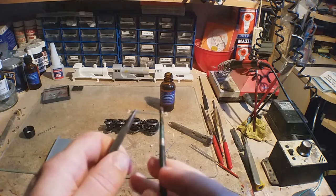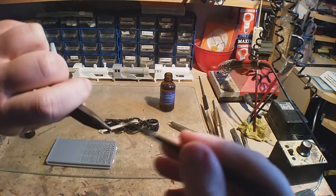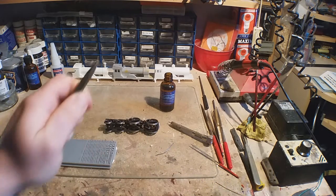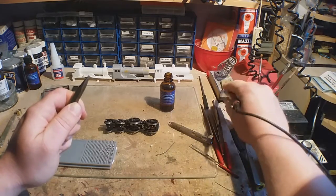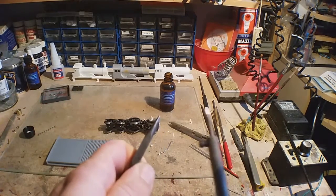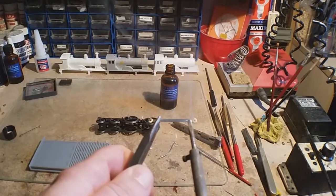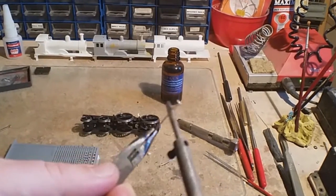You want to paint your rod with flux, all over. I would have done this beforehand, because it means I'll have to check the holes again, but never mind. And literally just paint your rods with the solder. Use a 145 like I have been.